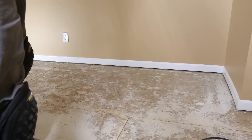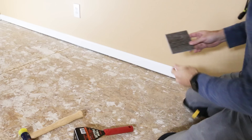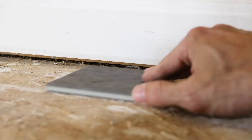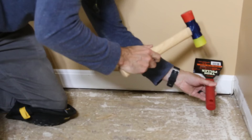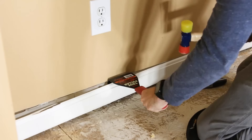The next mistake is probably more a matter of opinion. Leaving the baseboards installed definitely makes the job easier and it's pretty common, but you'll need thick quarter round to hide the expansion gap as well as the gap from the lower floor height when you take out carpet. I think the payoff of removing the baseboards is worth it for a nice clean look. Would you rather put in the work to avoid the quarter round, or just push the easy button and let it stay?